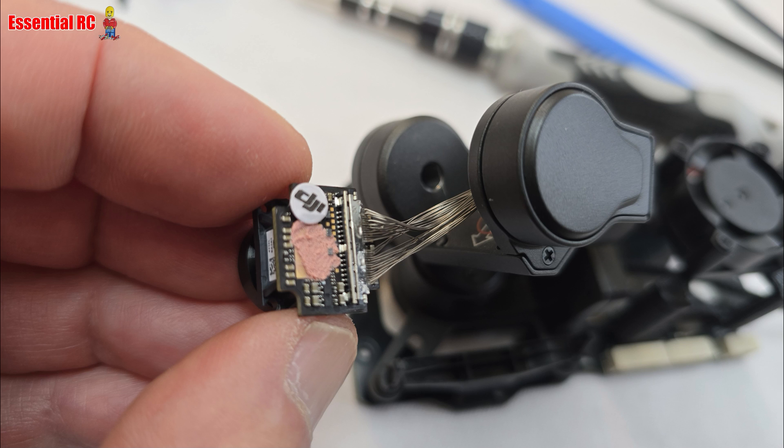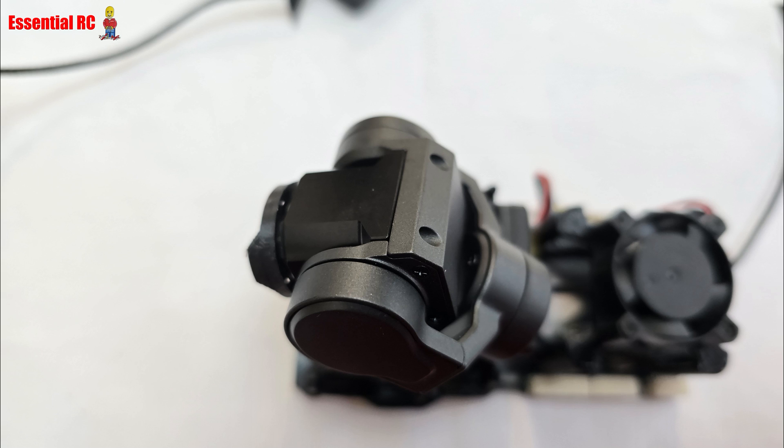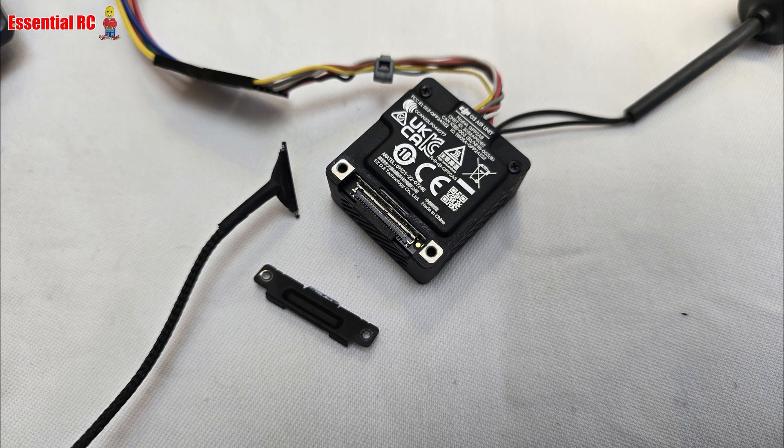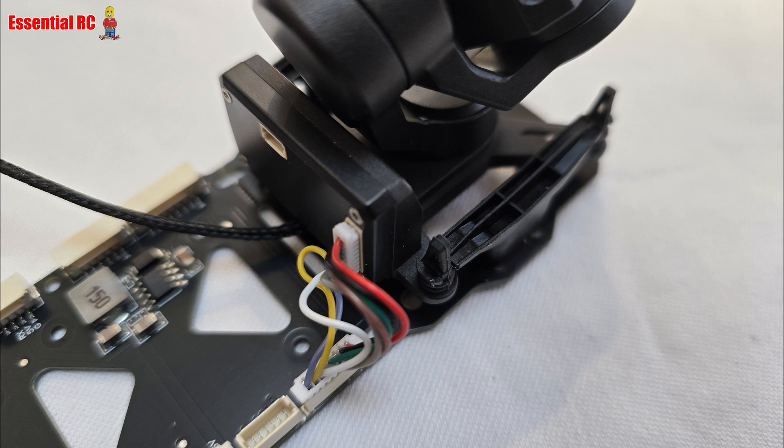Push the plug from the gimbal onto the back of the connector of the FPV camera. Click the lens protection ring onto the lens mount from the gimbal kit. Drop the FPV camera into it and secure that in place with the four screws you took from the DJI camera case. Attach that assembly into the gimbal using four new screws from the gimbal kit. Then find the cable in the accessories pack and plug it into the gimbal and the mounting plate.